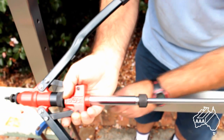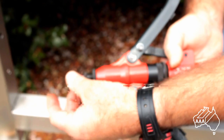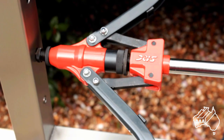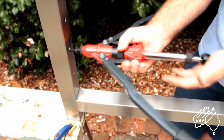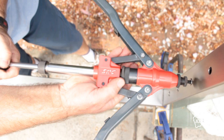Screw the left-hand blind rivet nut onto the left-hand mandrel. Next, push the blind rivet nut into the drilled hole and squeeze the handles together. This will crimp the blind rivet nut into the post. Fully release the handles and push the centre knob in. If you don't fully release the handles, the mandrel will not rotate and come free from the blind rivet nut when you push the centre knob in. If you are still unable to extract the blind rivet nut tool, just turn the centre knob clockwise to release the left-hand mandrel after crimping. You should always support the insert tool whilst you are doing this or you may snap the mandrel.